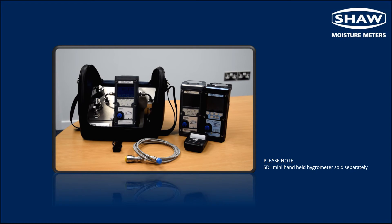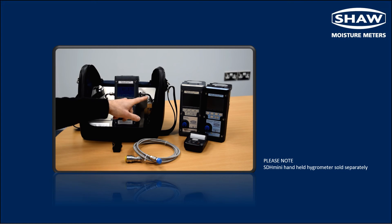To achieve atmospheric pressure, the SDH portable sample system is available with either a pressure regulator or a needle valve. For low pressure applications up to around 10 bar, the pressure can be dropped across a needle valve. For high pressure applications up to 210 bar, the system can be configured to include a pressure regulator which controls at 0 to 1 bar. The fine control of the pressure reduction helps to optimise the flow of the sample gas to the SDH Mini, as shown on the flow indicator.